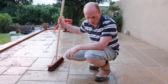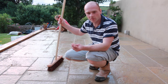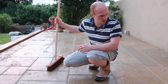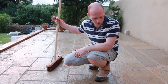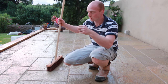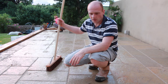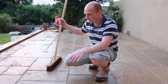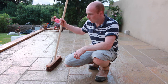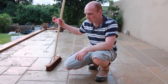It's going in well - pretty impressed so far. It's a kind of weird texture, almost rubbery and plasticky to start with. We've brushed it in and tried to keep everything as wet as possible. We're striking it off with a brick finishing trowel to get a slight concave joint, which is fine. Going around doing that, then topping it up where needed - kind of pushing it in to start with and then adding a little bit extra to get it nice and flush with the top of the stones.